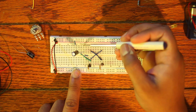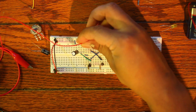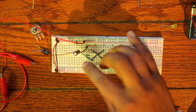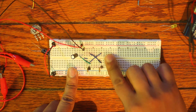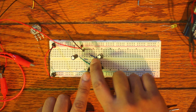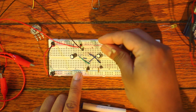I'm going to add the potentiometer. The positive side goes into the positive rail, and the negative goes on the same line as the positive part of the capacitor. Now we can move on to the right side of the oscillator with the other capacitor. Its negative leg connects to this crisscross, and we're going to add the 10K resistor to that same negative leg.